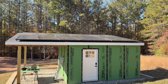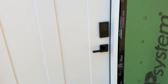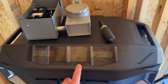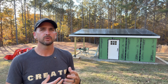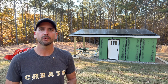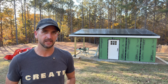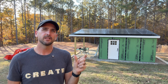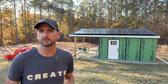Let's jump back to solar testing at 2 p.m. — where are we on solar input and state of charge? It's fall so we'll drop off quickly as the sun goes down, but at 2 p.m. we're still running 2,500 watts and 61% state of charge. For the solar input side, the Ultra X has 10 kilowatts of total solar input across two charge controllers — five kilowatts each — with a voltage range of 80 to 500 volts and up to 15 amps max.